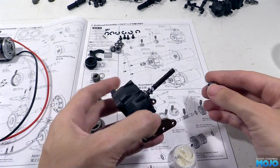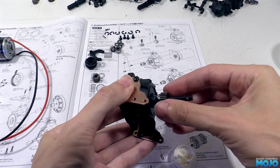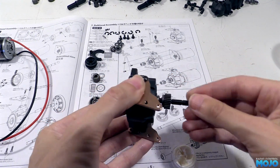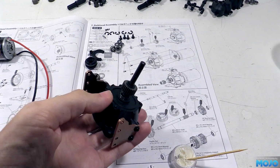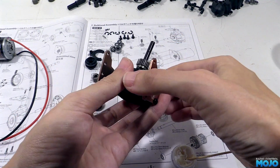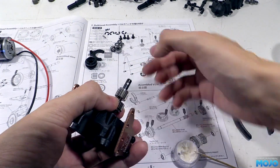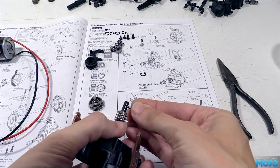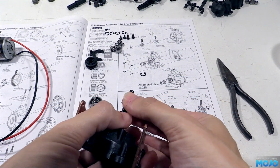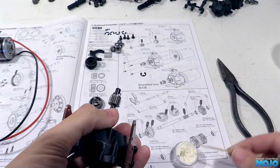The first gear on the shaft is the 26 tooth, which slides over the 9mm pin. It's then held in place with one of the large E-clips. The next gear needs to be fitted in the right order. First the gear goes on and slides past its final position. The 8mm pin goes into the greased up hole, and the gear slides back along the shaft to lock with the pin. And a little bit of extra grease around the pin won't hurt while we're here.